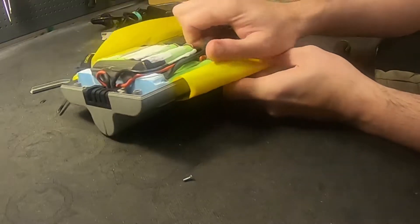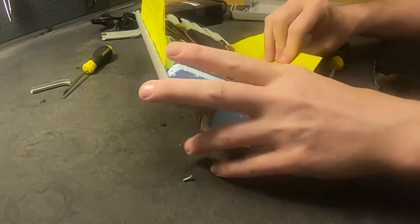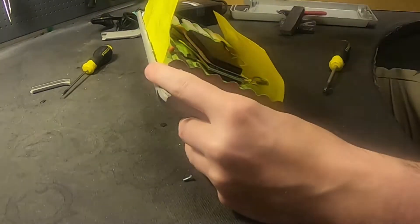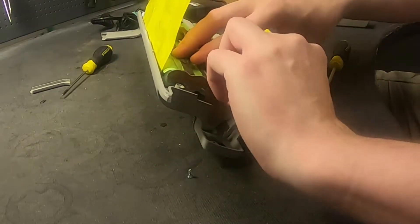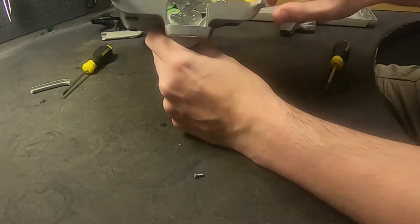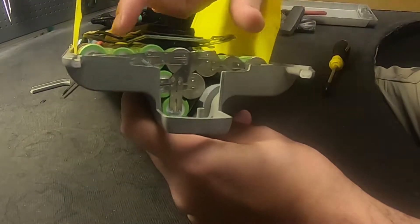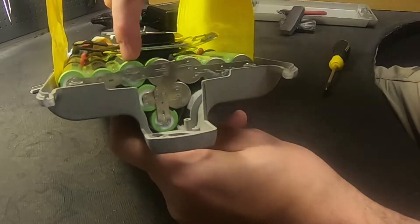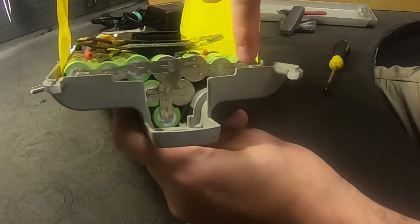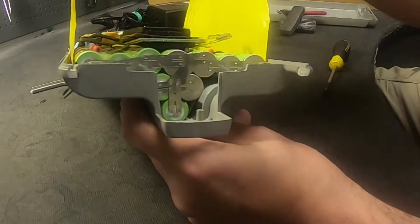The config is a misery of its own. Everything in here — I usually don't accept this, but it's been a while. You can remove this plate and you will see this stupid boat config. It doesn't make any sense. I have three cells down here and seven down here. And if you look carefully, you will see that these are not aligned in a line — they go down, they go up, they go down, they go straight, they go on the side. So you cannot use one strip and you cannot glue them together like this.